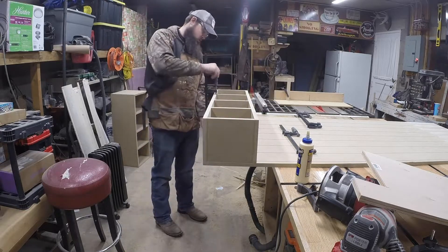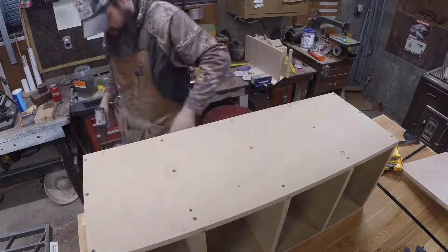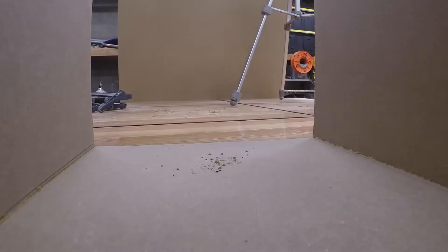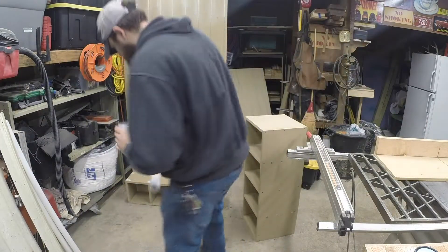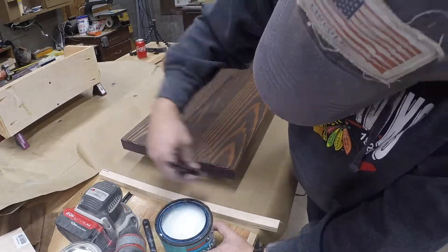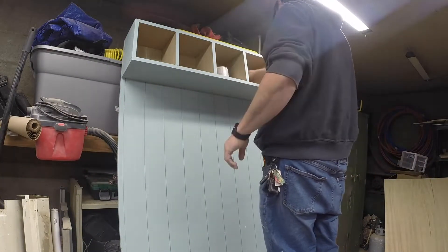Once I had all those holes filled, I took the top shelf and glued and screwed it to the top, then filled in all of the screw holes with the spackling. I found some leveling feet to put in on the bottom — I didn't have the actual sockets for the leveling feet, so I found some nuts that fit, drilled out the hole for them, chiseled out a little mortise for the nut to sit in, and hammered it home. Then I screwed in holes from the bottom to mount the top to the bottom cabinet. For paint, I used Rust-Oleum chalk paint in Serenity Blue for both cabinets and the backer piece. While that was drying, I applied water-based polyurethane to the top — two coats, sanding with 220 in between. My wife wanted a little contrast, so I used white chalk paint for the inside of all the cabinets. And then the project was done.